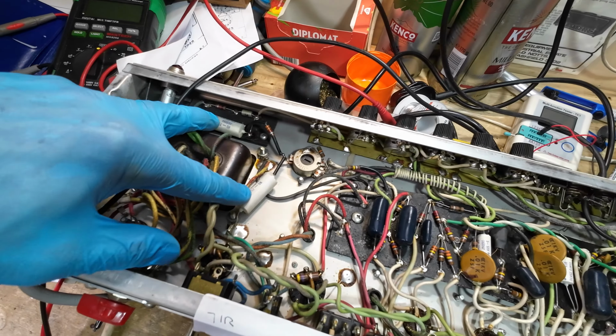Just to push the bulbs up a bit more. So you've got 200 watts of bulbs now. We've now got 175 volts, so we're not a million miles off. So let's just check that choke. Seems cool, cold. So no issues with that choke. Let's just flick off the current limiter now. So the current limiter's off.